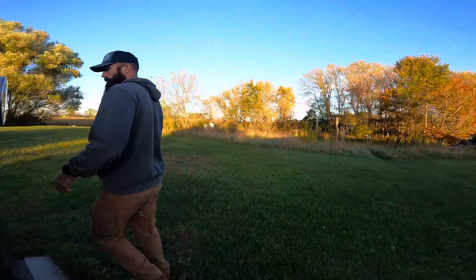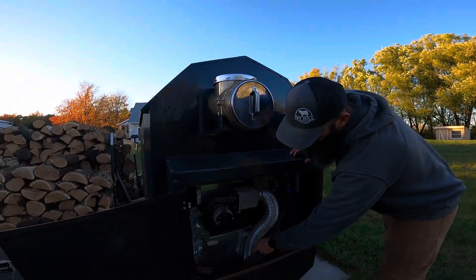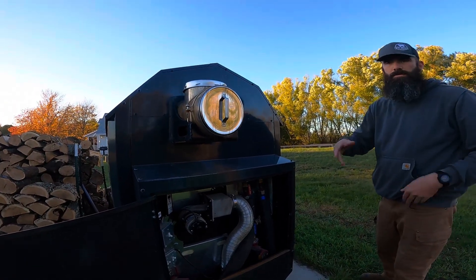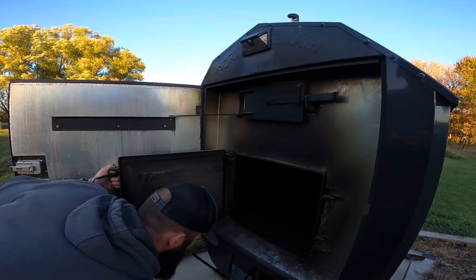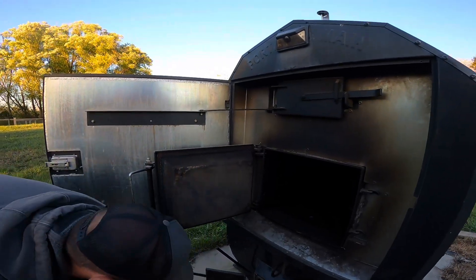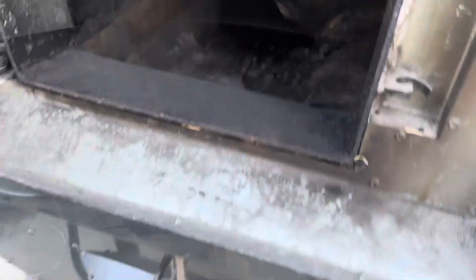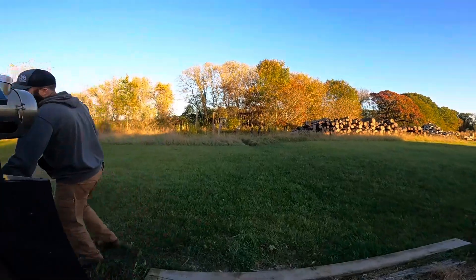That's a nice design because some other ones have top doors that blow sparks everywhere. The way these work is the blower motor is hidden behind and goes down to the front where the ash drawer is - it goes underneath. There's a little shaker grate and the air blows up from underneath. There's a small hole in the back and the air blows underneath and feeds up through there.